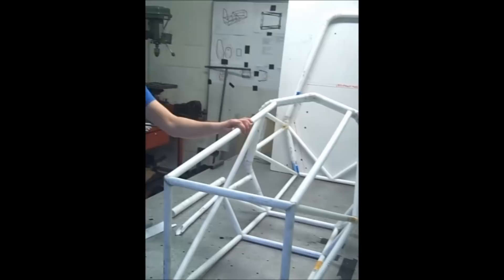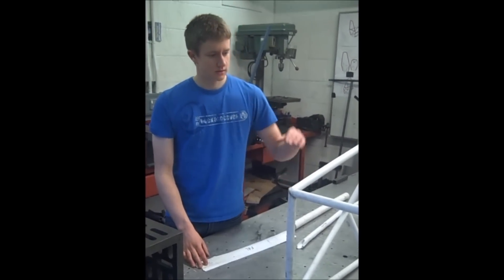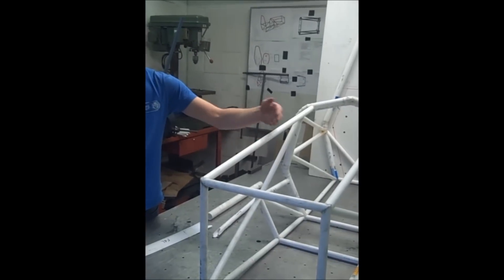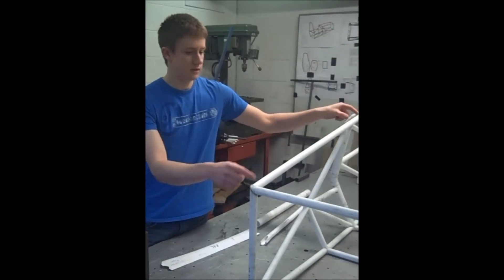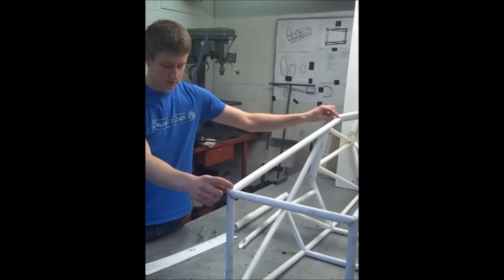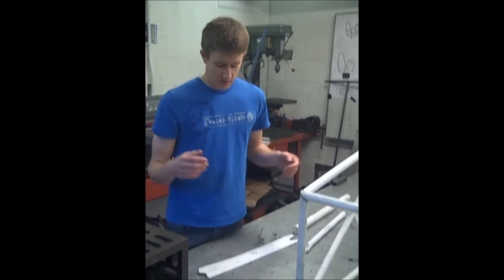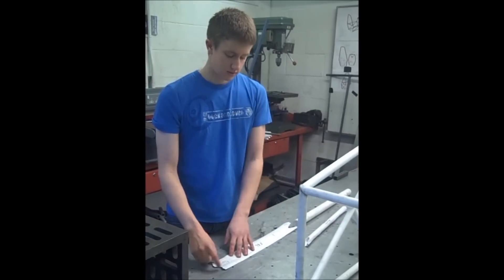To make the plastic model, first we start out with the CAD model. We can then take each of these tubes and unfold them in the CAD software to produce the profile for the ends of the tubes. We create a drawing from that unfolded profile, then print it off in one-to-one scale and cut around the ends.